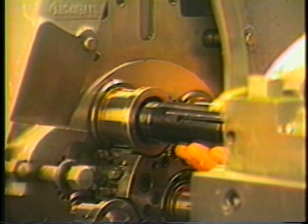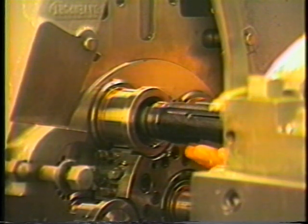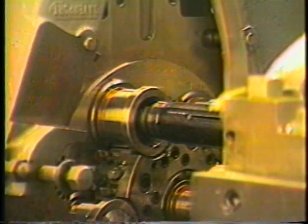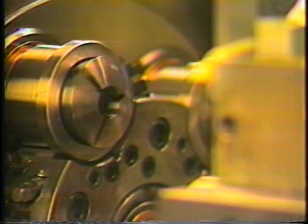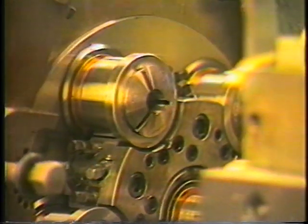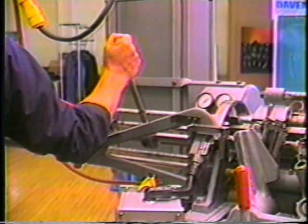Place the new collet over the nose of the chuck wrench. Align the drive pins with the holes in the collet and apply pressure to the chuck wrench pusher. Once the drive pins have engaged with the collet, draw the collet into the spindle and screw the collet into the inner spindle by turning the chuck wrench counter-clockwise or toward the rear of the machine. Once the collet is hand tight, use the cam lever handle to seat the collet.